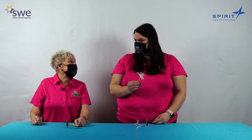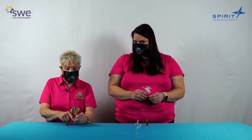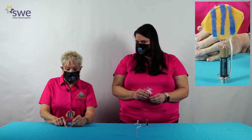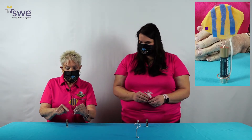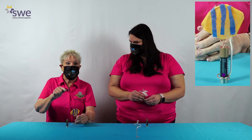So to recap, we made tiny dancers — and mine was a hot air balloon — using homopolar motors. What you do is, when you put your little ornament, whatever you make — a dancer or hot air balloon or whatever — on your battery, the current flow goes up through, touches this wire right here, goes around, down, and then hits this magnet down here and starts to flow back again.